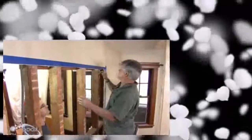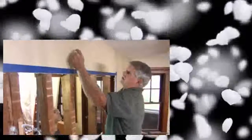So what I want to do is cut along this line right above each stud, creating a pocket for the beam to go in. By doing that, I'm leaving a piece of stud above the line to the underside of the plate. When I insert the header, it will hit the 2x4s and support them. The 2x4s will go up and support the plate. The plate will support the joist from up above.